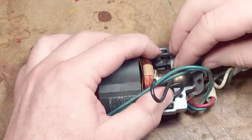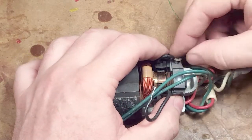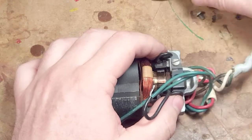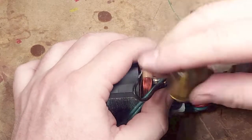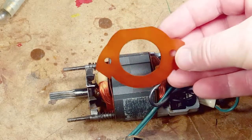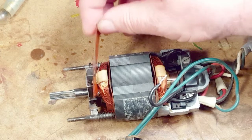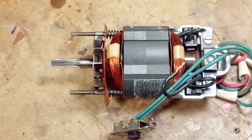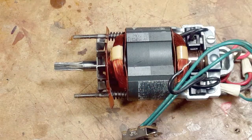I'm not sure you could do a motor repair like this now because the parts are — everything is machine assembled and crimped together, not really serviceable. This is very serviceable; it's relatively easy to remove those brushes and you could replace them with replacement brushes. I didn't even source any replacement brushes because these ones have a lot of life left in them. Finally I got that back in there — though I obviously had to do the entire job over again.